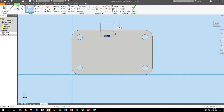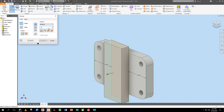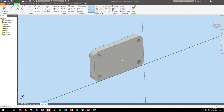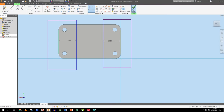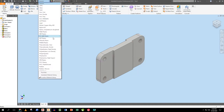I'll make another sketch on the top of the plate. There's a recess in the top that is 1.75 inches over from the right and left. I let the top and bottom of this shape run wild because it's going to cut air when I do the extrude cut — going an eighth of an inch in direction two. Then I flip it around, start a sketch on that surface, and put two rectangles, making sure this dimension is 1.5 and this dimension from the edge is also 1.5. I extrude-cut those shapes.